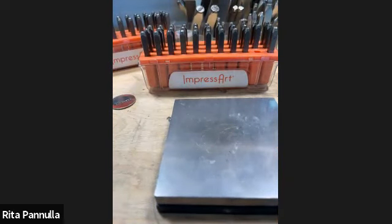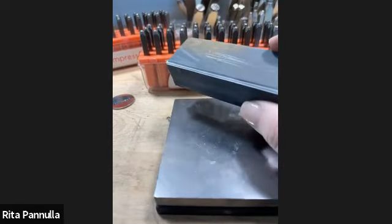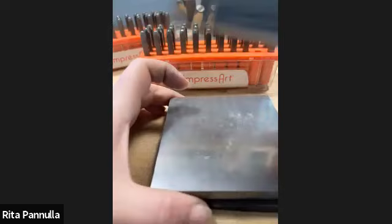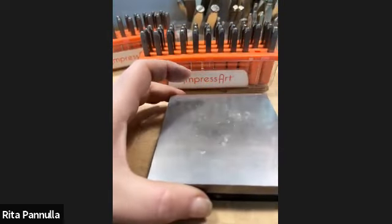Let's see. The question is about dragging the stamp too hard and leaving a line. Okay, so when you drag that stamp, how to prevent the drag lines from the letter stamps, I must have dragged too hard on aluminum. Okay, Cindy, how to get that out is you're going to come in with your sanding block, your medium side only, and you're going to have to mat that side and then repolish it again to try to get those tiny scratches out.